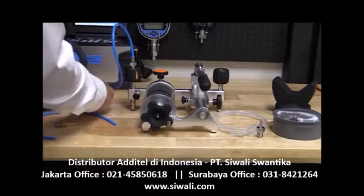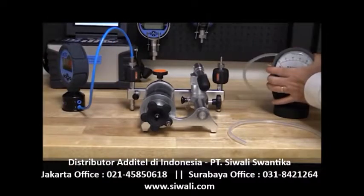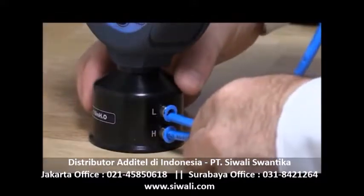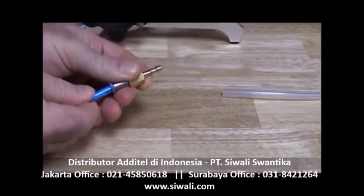For this method, the high ports of the reference and the DUT are connected to the 912 pump. The low port of the reference gauge and the DUT are connected together, which greatly reduces the influence of environmental errors.